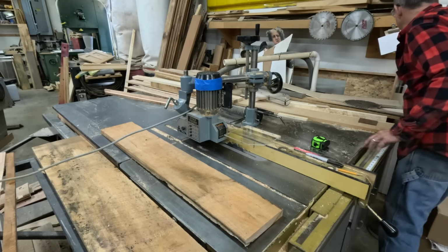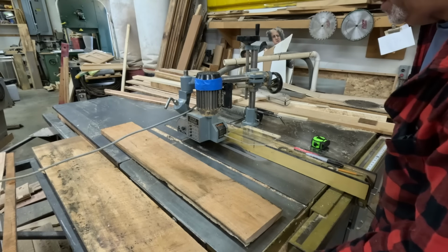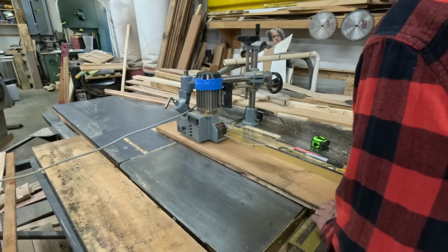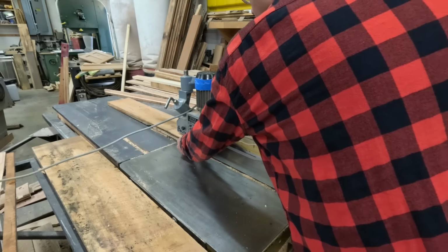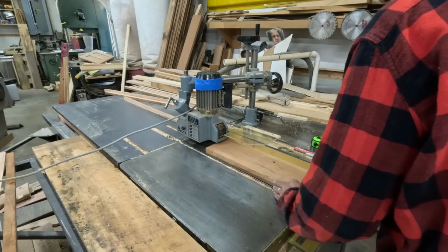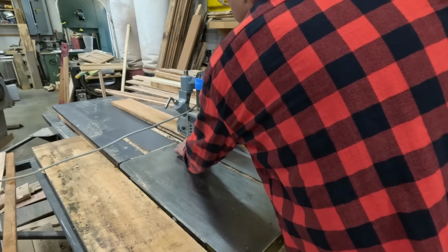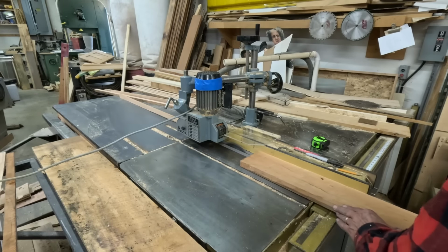So let's fire up the dust system here, turn on the little feeder, and we'll make some sticks. I'll try to stay out of your way here. I like to hold it tight to the fence and let it do its own job. Once you get to the back of the blade, the feeder will grab it. And I just let the stick fall off the table. If you had a helper, it'd be nice, but...